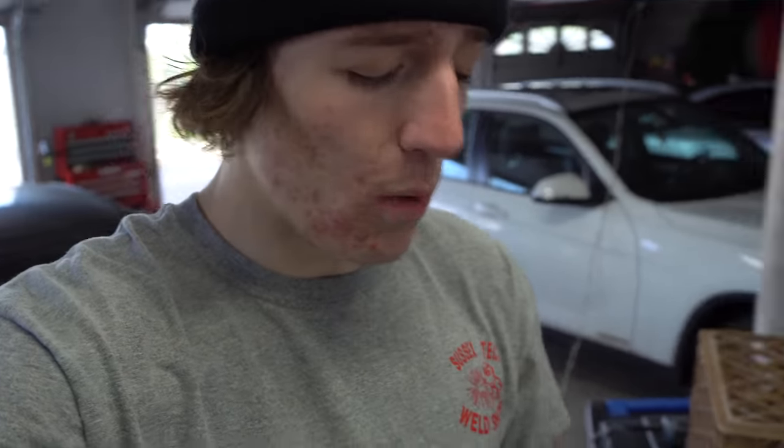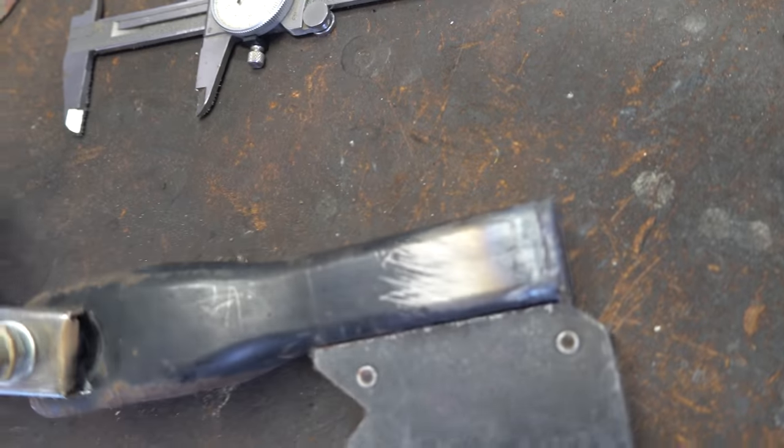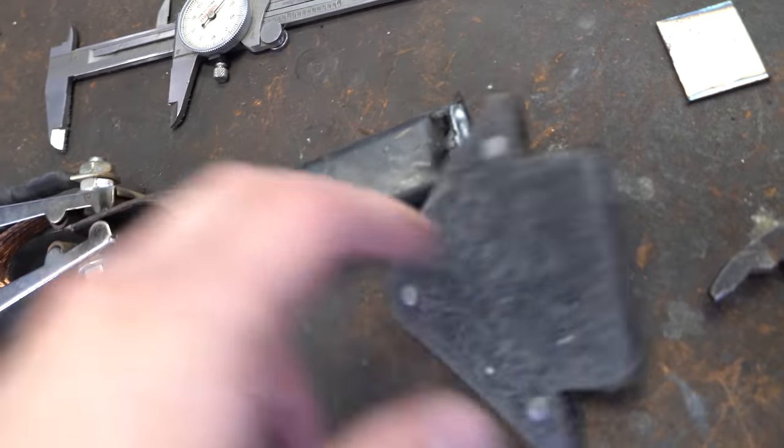This piece is super hot. I got all four sides welded up. I actually decided to drill the hole afterwards because I figured it might bow in the center and I didn't want that. I got all four sides completely welded up - welds look pretty good. I didn't use filler on some of the sides because the piece was hanging over, so I used that as filler and just blended it into itself. Still got to wire brush that side, but now we're going to drill the holes, put the bungs in, and weld the bungs inside.